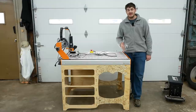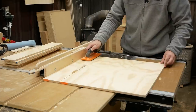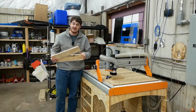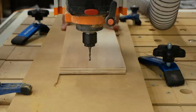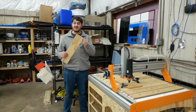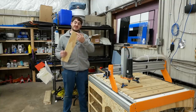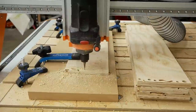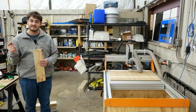Normally I would batch these out on the table saw and join them together with rabbets or box joints or something. But this is a CNC project — I'm still going to cut them out on the table saw. I may have cut these drawer parts out on the table saw and miter saw, but I'll be cutting the joinery using the CNC. And because I'm using the CNC, all the joinery is going to involve anything but straight lines and regular shapes. That didn't go brilliantly — I made one of my toolpaths narrower than the router bit, so it just didn't cut. And then I ran my router bit into an aluminum clamp. Somehow it wasn't damaged, so all I have to do is redraw the toolpath and keep going. Now to cut the matching joinery on the ends of these boards, I'm going to use the vertical clamping table.